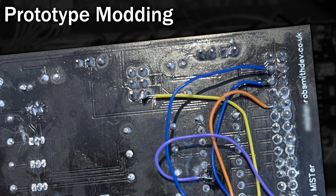With all good prototypes, nothing stays the same, and as I started writing code it became obvious that the way I'd connected the pins to the port expander wasn't very efficient. The port expander splits 16 pins into two banks of eight, but I'd randomly assigned pins based on how they fitted on the PCB, mixing input and output signals between the two banks. This meant I was reading or writing twice as much data as I actually needed. So I rewired all connections to put all output pins in the first bank and input pins in the second.